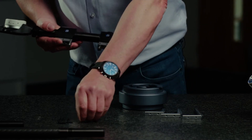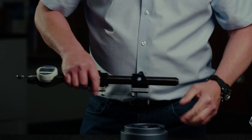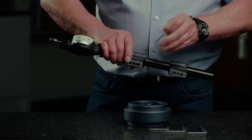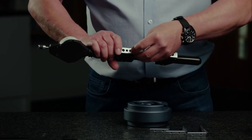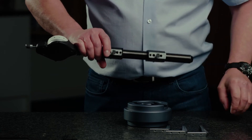To show you how quickly we can change to an external diameter measurement: I've got a diameter here on the outside which is actually within the measuring range of my moving anvil. So using this different tooling location and setting the rotation of the anvils to external.